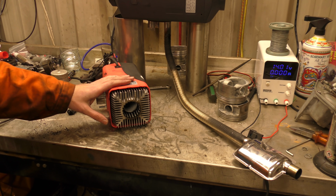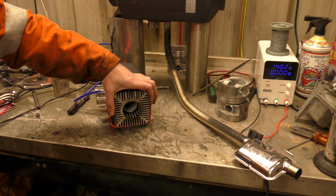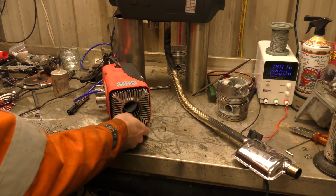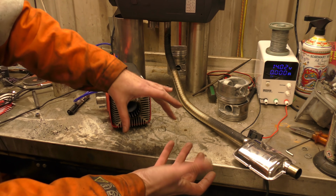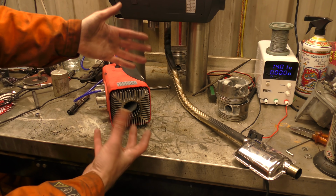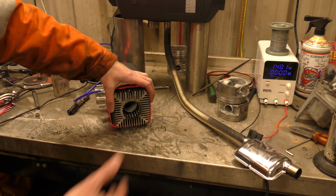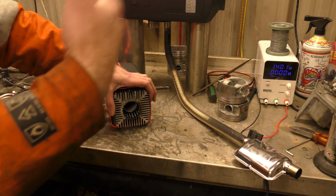I've learned a thing. Now, you're probably wondering, you've just wasted a diesel heater. What are you going to do with it now? Well, now I've seen that it will run without its end cap, I could make a plate that fits on here with perhaps a tube in it, and then into an intercooler perhaps, and then out to another chimney, and then have fans blow all that heat out through the intercooler. Then you're not losing any out of the exhaust. All the heat would be made into heat. You know what I mean? All the actual burning gases would be transferred into heat into the workshop.